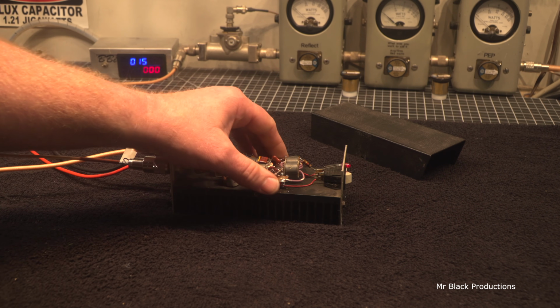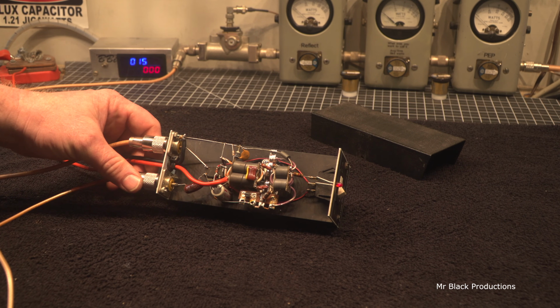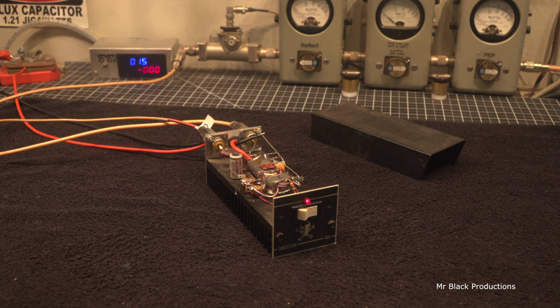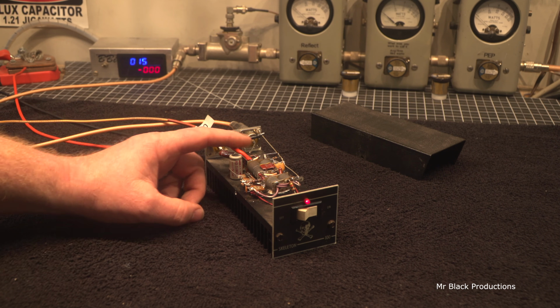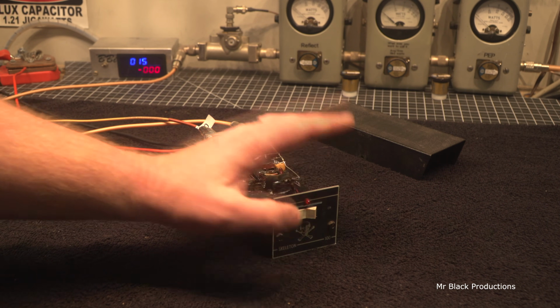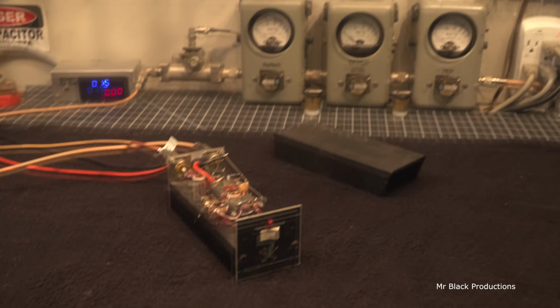There's a piece of copper that goes down the middle for our ground bus. Everything is what they call free-air construction. We see that a lot of manufacturers copied this exact design. It's got a little filtration cap in it, a little tiny 5 amp relay, single transistor, and it's on and it's off. And this is straight up AM only run-on box. There's no other stuff inside of here. It is just straight up wham bam, thank you ma'am, and I'll see you, bye.